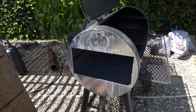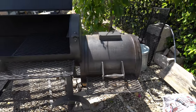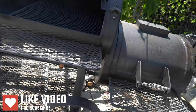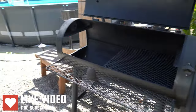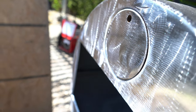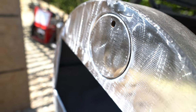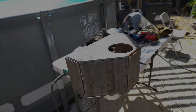For you guys concerned about hanging a lot of weight on the end of that smoker, this is just going to add to its strength, rigidity, and longevity. And don't forget there's a firebox hanging off the side that's probably as heavy as the plenum is going to be, and it's not held on by as much as what we're doing here. So rest assured this thing is going to be strong. Here's that bevel Nathan was talking about - it's going to ensure that weld is strong. For anyone wanting to tackle one of these fabrication kits, that's what you want to do.